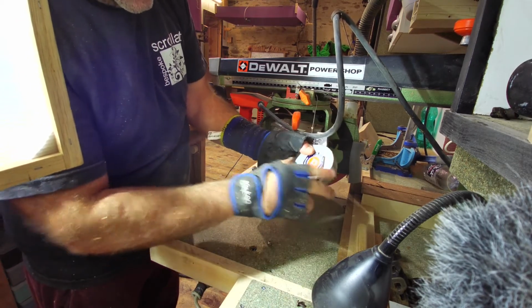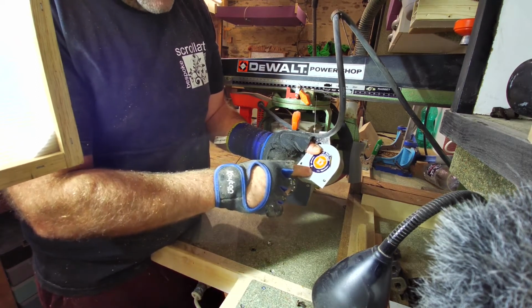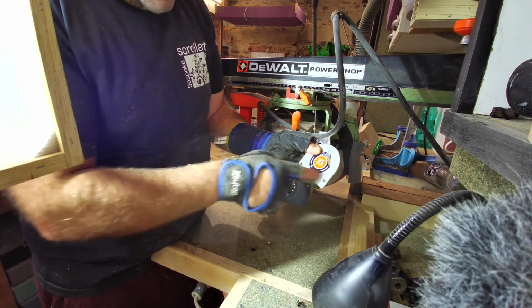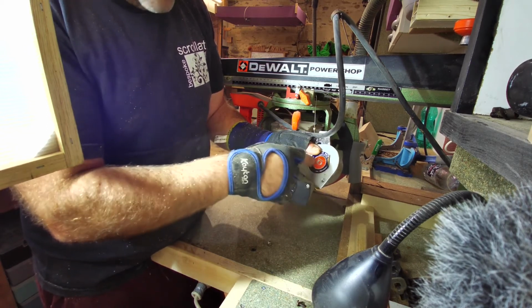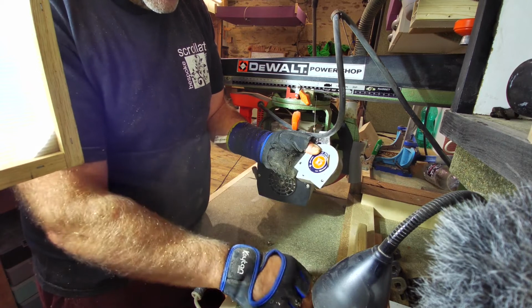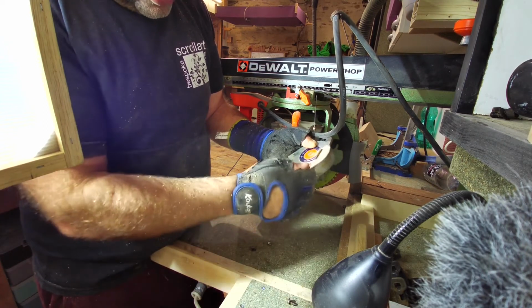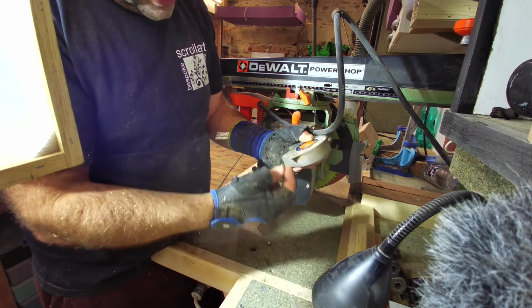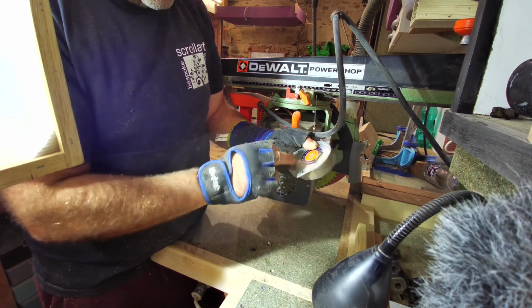Ah, and now I get it. See, where it says positive and negative, basically you'd wind this face cover one way to increase the resistance, and the other way to decrease the resistance, and then you put the screws back in to lock it off. Now, what I don't understand, I don't think these two screws here are original. They might be, but they're just two stainless steel screws that were holding this cover on.